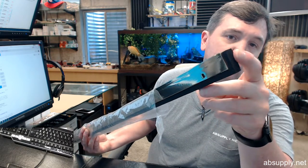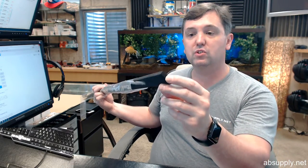Assuming it's a door sweep or whatever, you're just going to measure the distance between the stops. If it's a door sweep, you'll probably want to deduct a little bit, maybe 1/8 of an inch total. The sponge neoprene will run long. That's always the case. You're going to trim that in the field to suit your conditions.